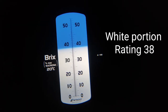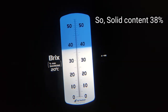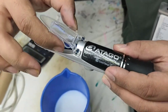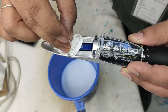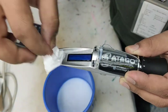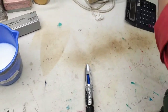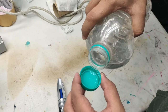I am watching the scale measurement and trying to show you — please note that the white portion is now around 38. So the solid content percentage of this chemical is 38 percent. The white portion is the main measurement on the scale. Before using this chemical the whole scale was blue, but after applying the binder the white portion is visible at approximately 38.